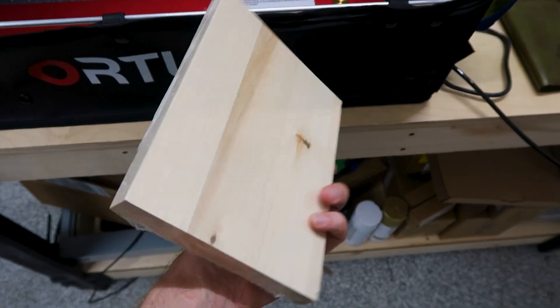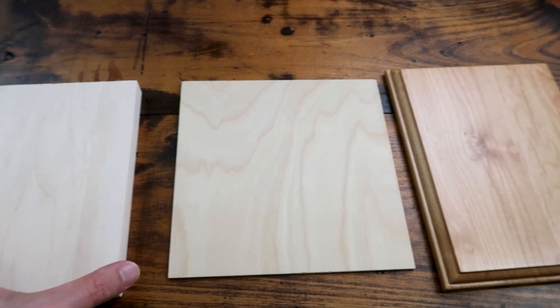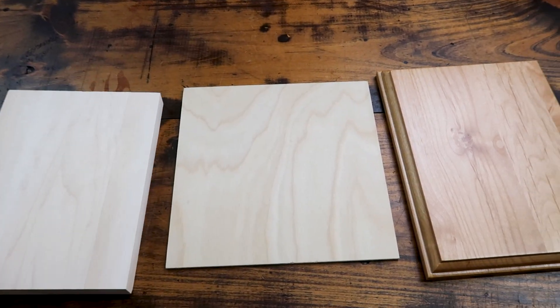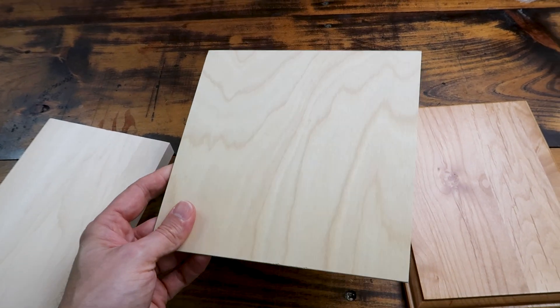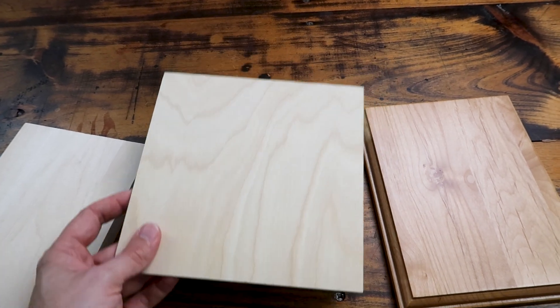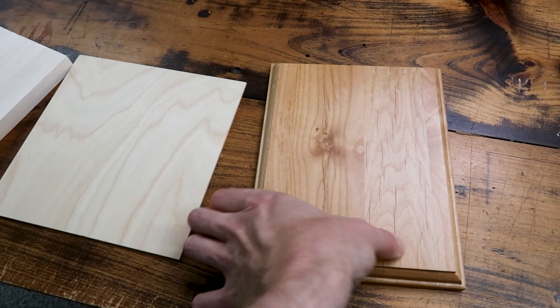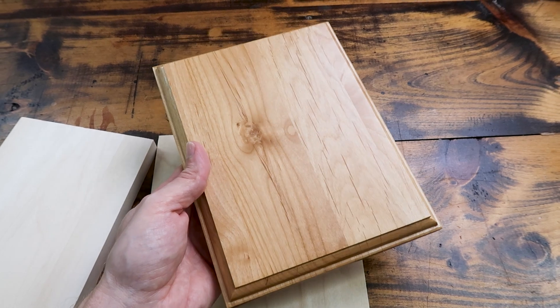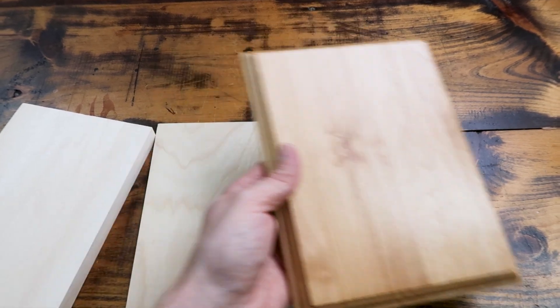It's really hard to find a piece of wood with all of these characteristics, but some of the best species for engraving are alder, cherry, and maple. For a more affordable and available option, I like to use basswood. Pine is okay, and Baltic birch is my least favorite. Here's a quick look at three wood examples: first is a basswood plaque with a nice light wood color and minimal grain pattern; next is Baltic birch plywood with a more pronounced grain and a slight yellowish tint; last is a red alder plaque — much darker wood color and more pronounced grain, but the tight finished surface produces a really nice dark engraving.